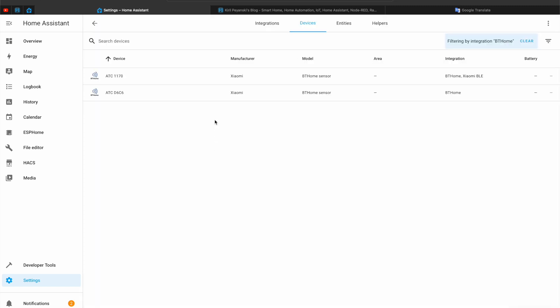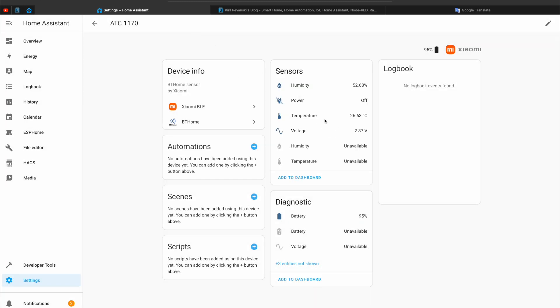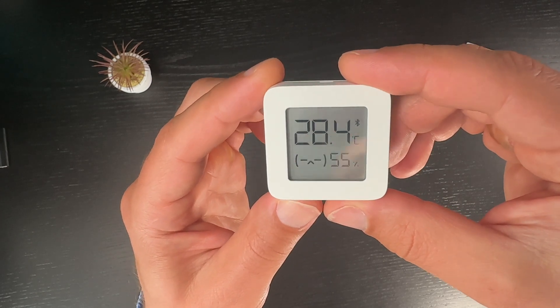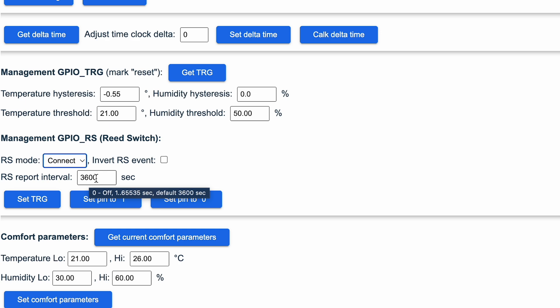From there I can use the sensor readings to create home automations — like starting heating or cooling if the temperature goes below or above some threshold, sending notifications, or everything all together. The possibilities are endless. What is cool about using this custom firmware is that you don't have to deal with the Xiaomi app at all. You don't need bind keys, and you can add some additional cool features to your device in just a few clicks. For example, I can show the battery percentage on the device display, or I can add a clock — features that are not available at all in the stock Xiaomi firmware. You can also adjust the update interval, which is the time the sensor broadcasts temperature and humidity readings to Home Assistant, but I suspect this will decrease battery life, so I prefer to leave it as is.